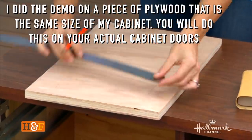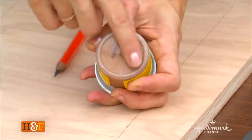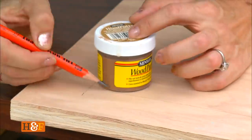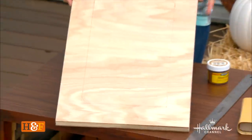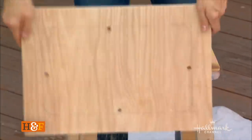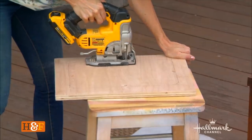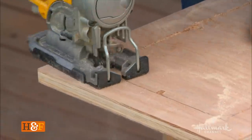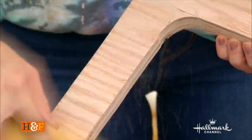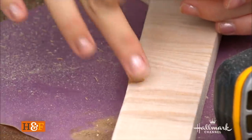I'm going to show you on a piece of plywood — about a two-inch border was the dimension I could cut while maintaining structural integrity. I plot two inches across, line up my ruler, and connect the lines to create a rectangle with a two-inch border. Use something round like a soda can to create the oval rounded edges. You'll need four pilot holes so the jigsaw can go in, and use a smaller blade for rounded edges. Many cabinets will chip when cut if not solid wood, so sand it down and put a little wood putty to soften it.